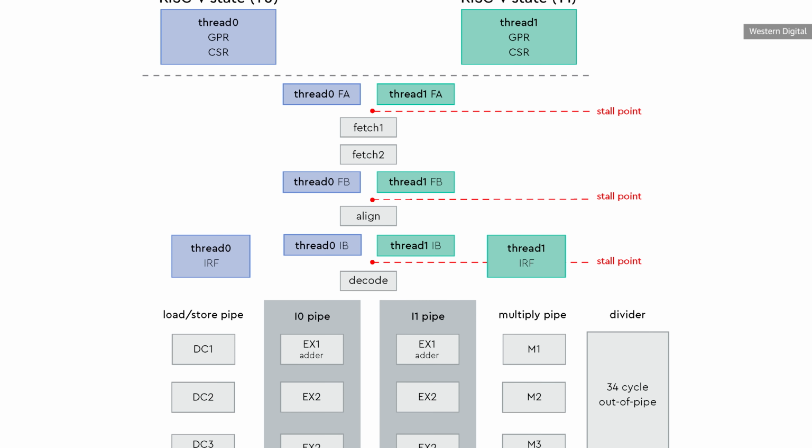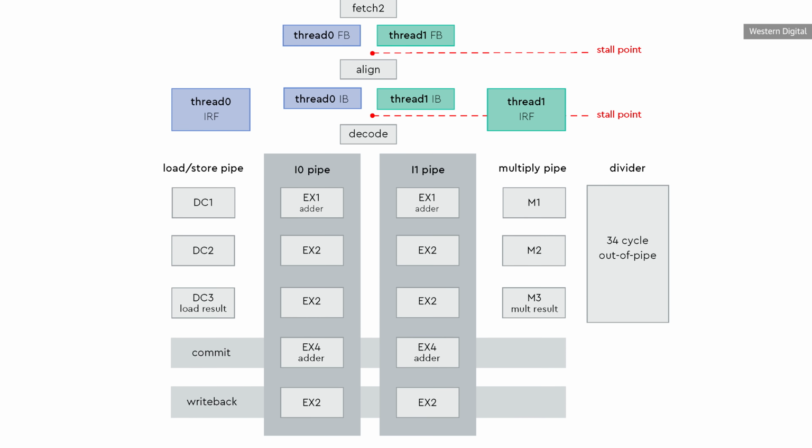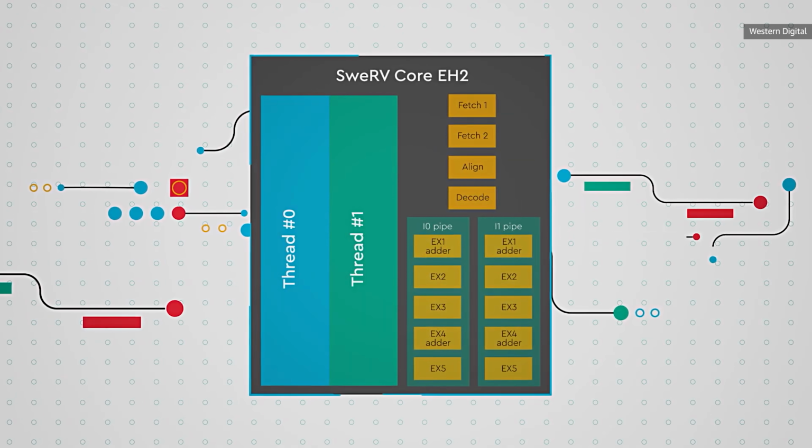Morena told me their engineers realized that some of their products would get better performance if their storage controller could handle 2 threads at once, essentially issuing 2 instructions at the same time. However, there was no dual-threaded embedded controller anywhere on the market they could buy, so some of their products just ended up having 2 storage controllers in them, which adds to cost and power consumption. With RISC-V, the company designed a chip that does exactly what they need.